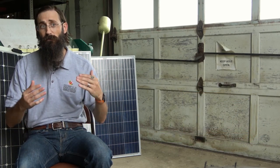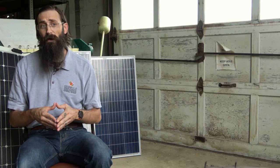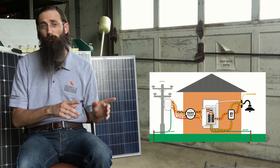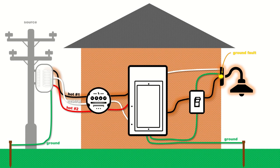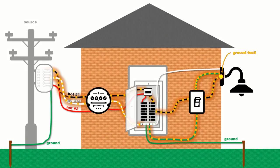Earth grounding will not remove any dangerous touch voltage and will not provide the path needed to clear a ground fault, since the earth will likely not carry a sufficient electrical current to open an overcurrent device. In order to clear a ground fault, you need to have an effective ground fault current path with low impedance from the point of the fault all the way back to the source. A ground wire will provide this low impedance or effective ground fault path, allowing the electrical current to more directly flow from the location of the fault back to its power source. A ground fault — the undesirable flow of current through the grounding conductor — will take this easier route through the service panel to facilitate the operation of an overcurrent protection device. In the case of a fault, the current will flow through this ground wire into the service panel, through the bus bar, and return to the power source via the neutral wire, with the neutral-to-ground bond in the service panel completing the circuit.